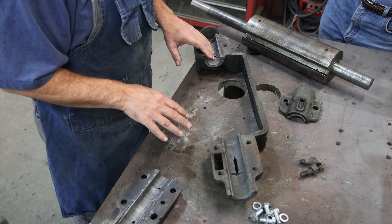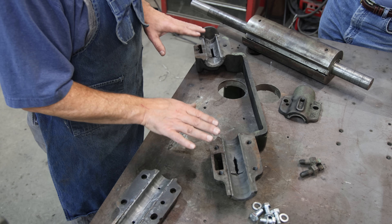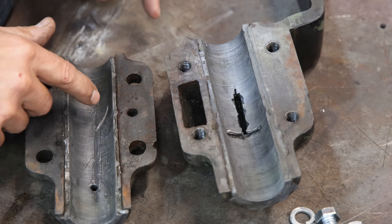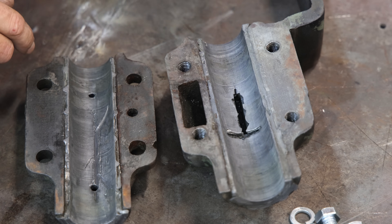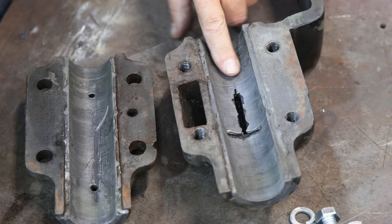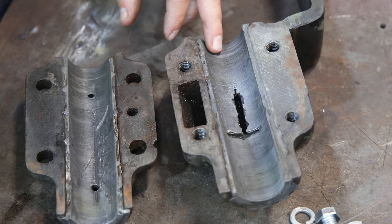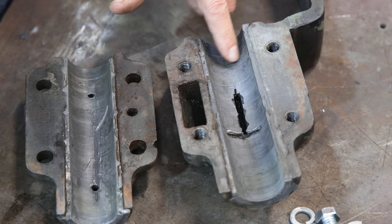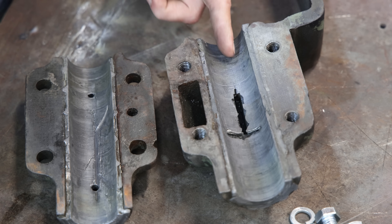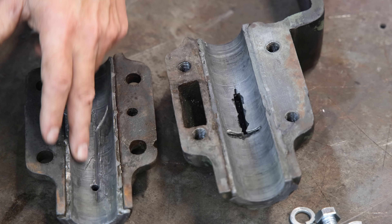When I'm looking at these Babbitts, the first thing I want to look at is what does the condition of the surface look like — is it smooth, is it scored, is it messed up? Looking at this bearing, the motor pulley side — first thing I'm going to look for is any scoring, any galling, anything that looks really bad. You can definitely see some lines in here where it's been used over the years, but there's nothing really raising a big red flag. Usually when they're shot, it's really obvious — big chunks missing, galling, where it got hot. I think we can take a little bearing scraper and clean this up a little bit, get some of this roughness out, and we're going to be just fine.